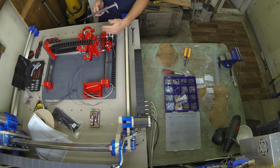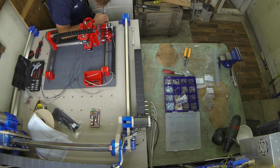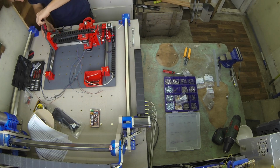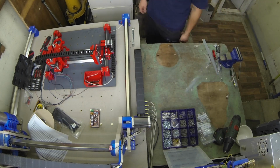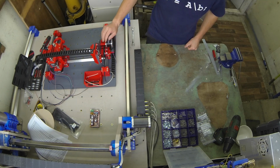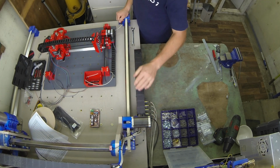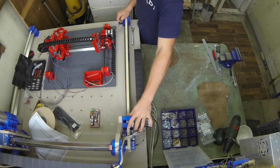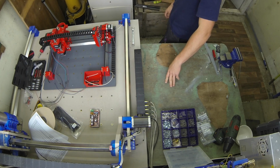So what we need to do is lock the motors in place, but for now we can get a good enough figure against the end stop, against the plastic parts, because we already know they're the same distance. But normally you would have the machine powered on, have the motors engaged, not driving, and then adjust it from there, so at least you know they're not going to move. Starting to look like a machine now. Just moving on. They're quite strong motors, so that's why it's quite hard to move that one. It's so small. That looks good.